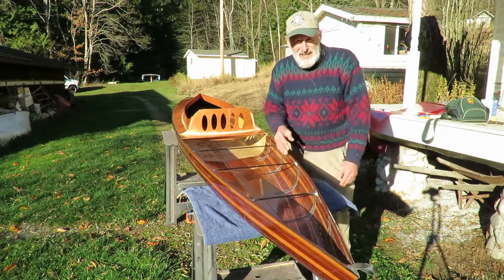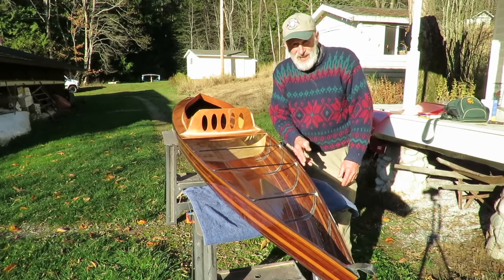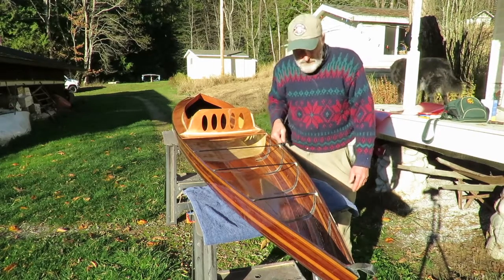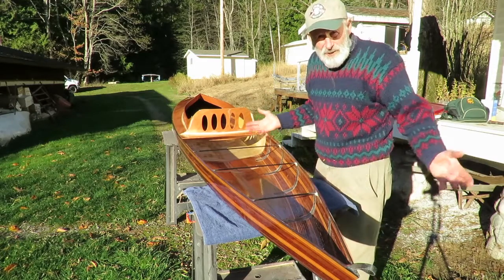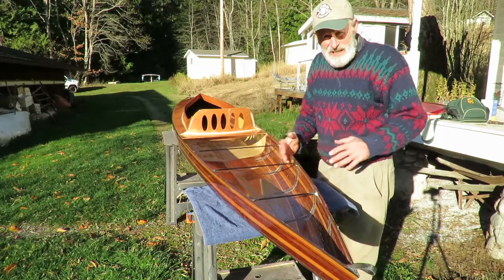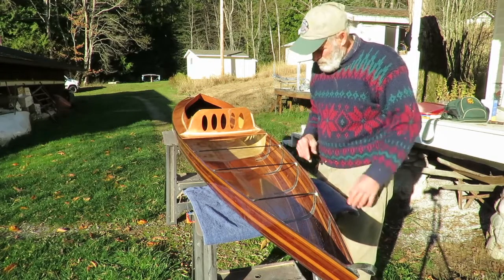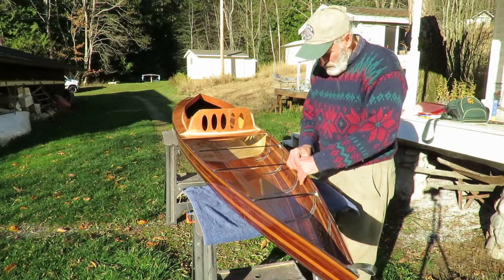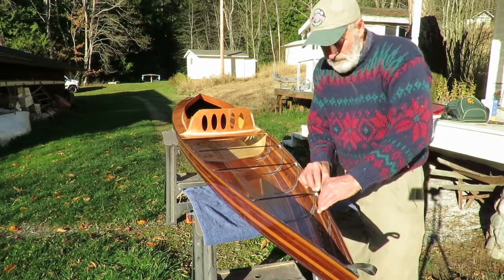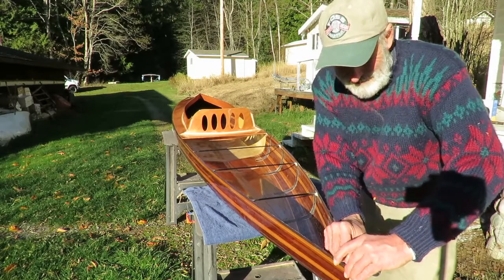We're just going to roll that down and stick it to the boat on the outside, and figure that the decking won't roll over that far, but the black tape will cover over it. And so we're going to try this system instead of trimming the orange tape. Trimming the orange tape works fine too, and that's the way we show you in the first video. So if you do everything exactly the same as in part 7 of the first set of videos, you'll be in great shape, but we're just trying something a little bit different this time. Okay, so we're going to push this orange tape down tight on the outside rather than trimming it off. The trimming off worked fine, but it's easier to push it down instead of trimming it off.